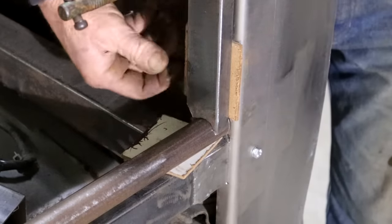Step 3, I must just locate the holes and put my pins into the bushes. That's that one, this one lined up, and it's in as well. Look at that! I love it when the plan comes together — that's going to be great. So my frame will now weld on like that, and then when it swings down, it's going to work very well. The lip on the bush is going to ensure there's no sideways movement, so we won't have any rattles.